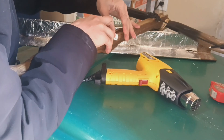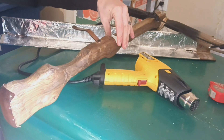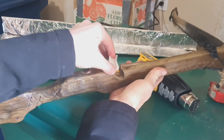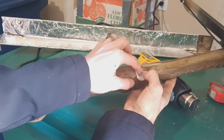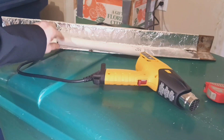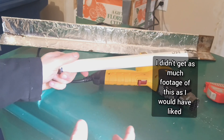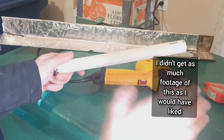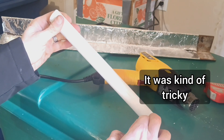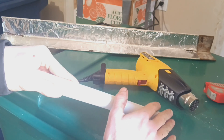This is also going to add a considerable amount of strength and wear resistance to where the string notches up. So now we've got our little piece form fitted — you'll notice it has a nice radius to it, so that way when the string latches on there the string is only bent around it. For our trigger mechanism, this is going to be kind of tricky. The way I'm going to end up doing this is quite a bit of heat molding. First we're going to flatten it out entirely, then I'm going to run a rip cut up the middle of it. Once I have those limbs made I'll be able to heat shape them into the prongs that I'm going for.